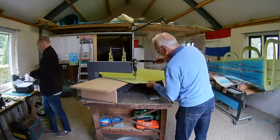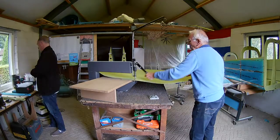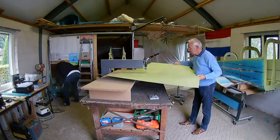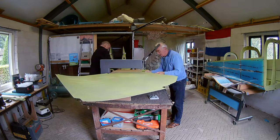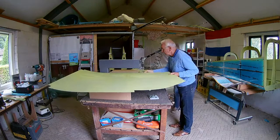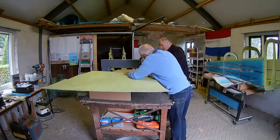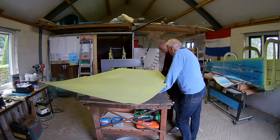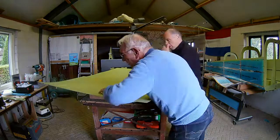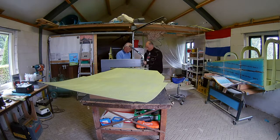You have to be careful. What I'm doing currently is using some plate nuts that are necessary to attach the floor panel. You need to use a thread tap to make it a little bit easier to go in there, because mostly nut plates look like they are a little bit squeezed — after they have been threaded in the factory it looks like they are squeezed, just to make it impossible for bolts or screws to get out. But since there is not very much room for the seat panel, they say that you should thread it.